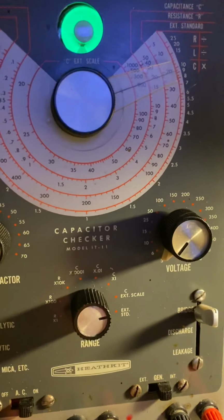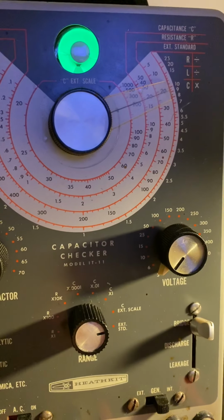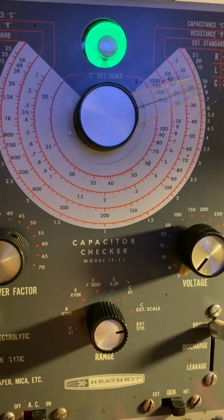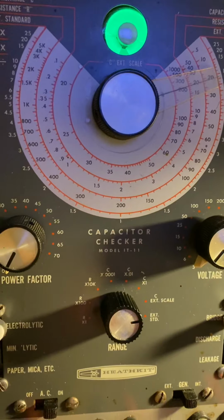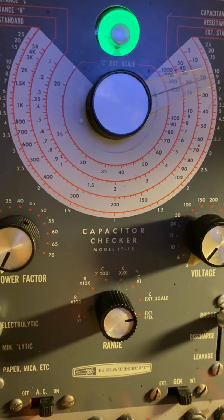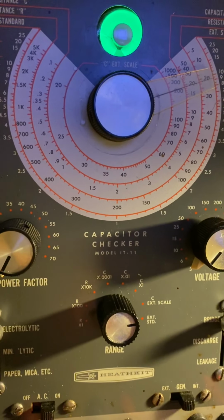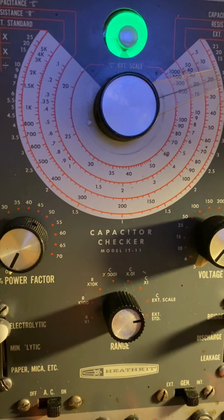Basically, see, it's opened up at 3 volts, but it's leaking. Doesn't matter, she's leaking. Just to let you know, you cannot leave these caps there. You're looking at caps from the 1960s, some that I've taken off from 1959, 58. You may think it's good, but it's not.